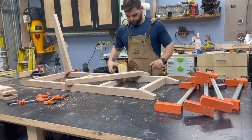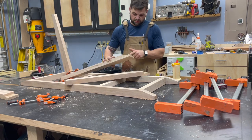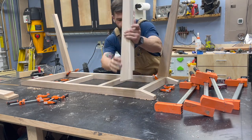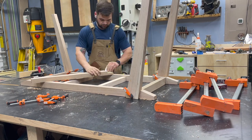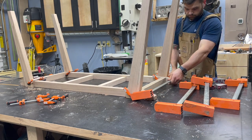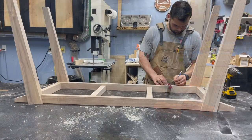For the legs, I'm just rubbing glue into the half-lap at that shoulder and using a little F-clamp to hold it in place. Making sure everything's aligned and flush, and working my way around — it's a super strong joint, face grain to face grain, with the shoulder sitting on there. If you wanted, you could send some screws in from the inside just to really snug it up. I let everything sit overnight to set down flat.